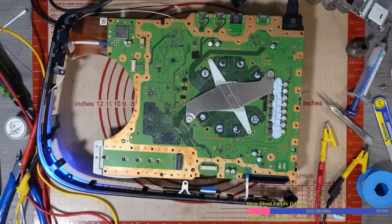But if it finds an issue with anything whatsoever, which could be construed as a catastrophic failure, so, for example, one of the RAM chips failing, one of the SSD chips failing, the Wi-Fi chip failing, it would basically just stop. And it keeps trying, and it keeps trying, but it never gets there, because there's something wrong with that area. And it just continuously pulses because it keeps trying. So that's the problem with the long pulsing blue light of death.